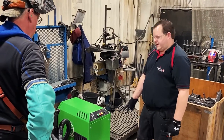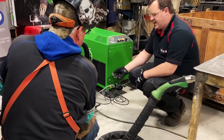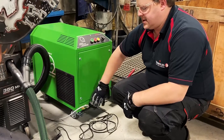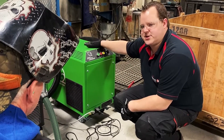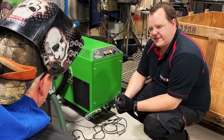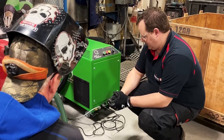We have three connections on the unit. The first one is the power — we hook up to whatever power source you have. The second connection is this low voltage auto start/stop clamp. I have put this clamp over the ground cable. What this does is allow the welder not to worry about touching the machine — when you strike an arc it senses the current and turns the machine on instantly. It's got an auto start immediate on and a 20 second delay off, so it allows the smoke to clear through the gun.